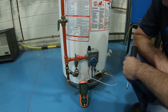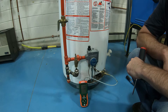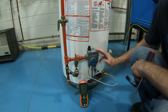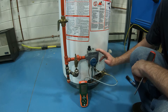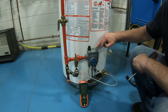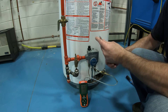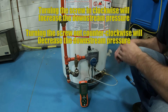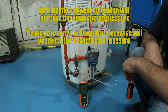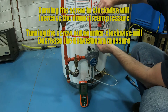We're looking pretty good — I'm registering pretty close to 3.5 inches of water column. Now these gas valves are adjustable; some hot water tanks are not, but most gas valves are adjustable. Right here there's a little adjustment screw — it is a flat-bladed screw. If I turn the screw in I will increase the pressure; if I back that screw out counterclockwise I will decrease the pressure.